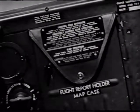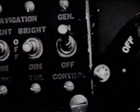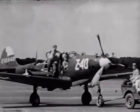In the first place, if he'd had the clutch handle to manual, he could have cranked the gear down without any trouble. In the second place, if he needed help remembering emergency operation, there was a card of instructions on the door. In the third place, if the generator had been on, the battery wouldn't have gone dead in the first place. The moral of that story is, know the airplane you are about to pilot.